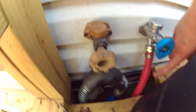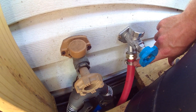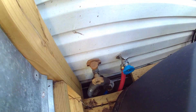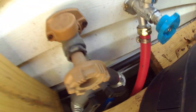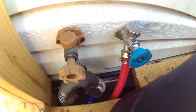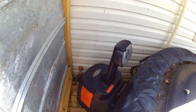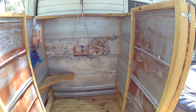I've also found that with 3/4 inch PEX you can put in hose couplers. So if you want to connect to the 3/4 inch screw-on system that you use for a standard exterior hose, these repair pieces — like a buck fifty or something at Walmart — will just slip right in. You can tighten it down with a hose clamp and have no leaks whatsoever, it fits perfectly. I highly recommend doing that. Then it's a modular system that you can kind of take apart — it's exterior, you can remove things as you need to, and it's not official plumbing so you don't have to worry so much about freezing.